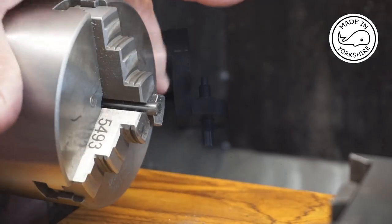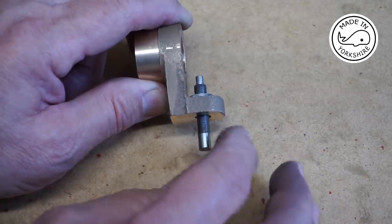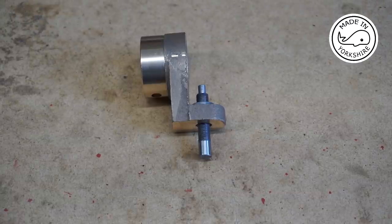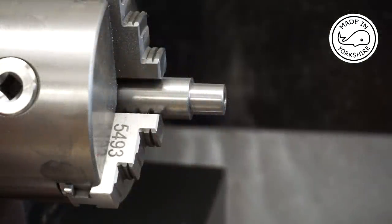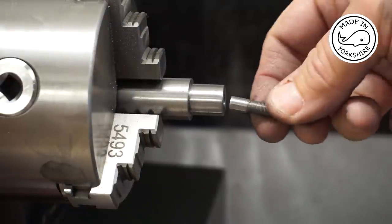Well, that's turned out very well. Very happy with that. Now the instructions suggest that you actually make three of these, one for each boring bar, but to be honest, I'll only ever use one boring bar at a time, so I'm just going to make one of them. So for the knob, it was just a matter of turning this piece of bar down to dimension and drilling a 1/4 inch hole in the end, and